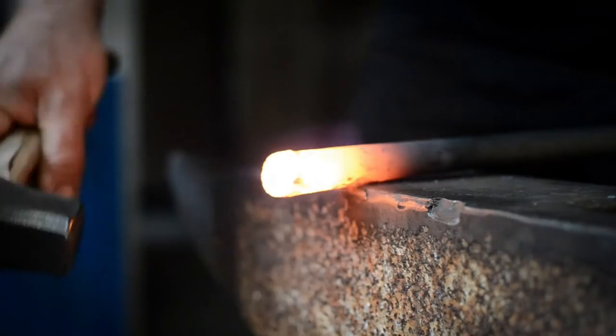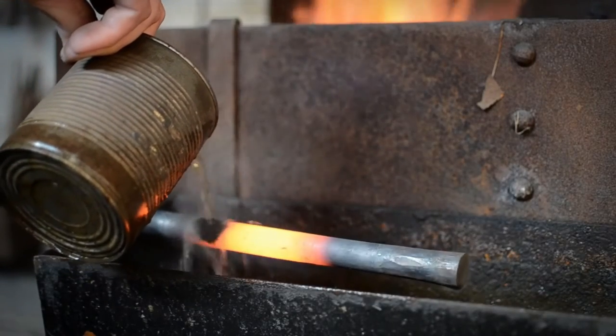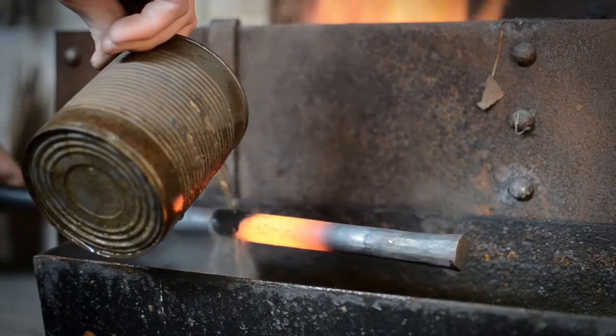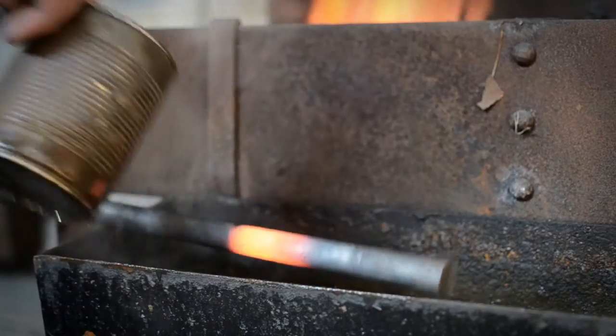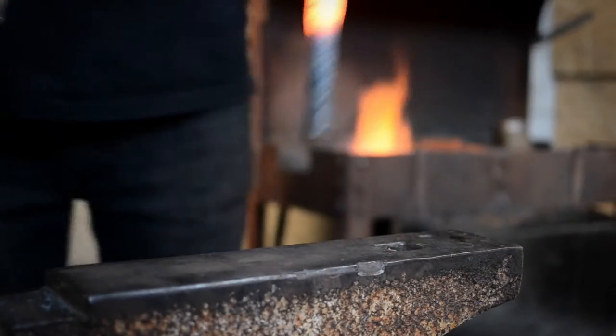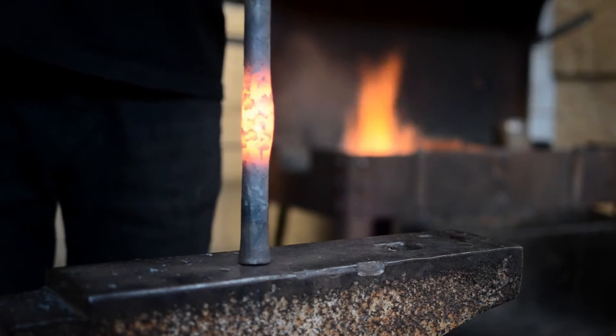Much practice is needed to upset the material in exactly the right place, because it takes a precise knowledge of both the heat of the forge and how to place that heat. The job may be made easier by heating a larger area, then cooling it by pouring water onto the bar using a can or cup, leaving just the right amount of heat in the right place for the first upset.